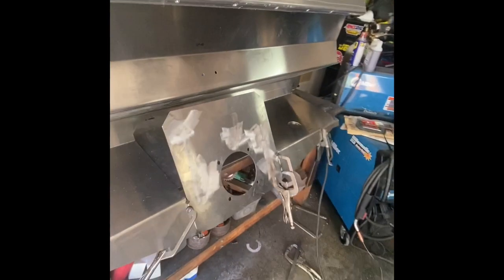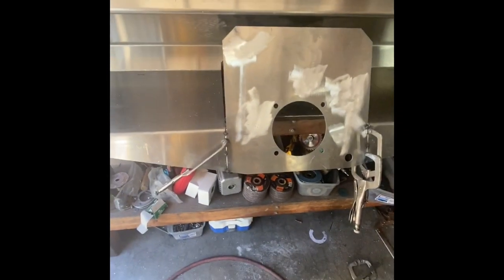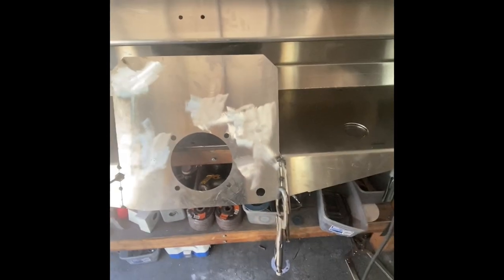The transom isn't exactly a simple one-piece deal - because of all the press brake work for the swim step, you kind of have to piece together the actual transom plate and the tunnel box for the hydro blaster. I got the face plate in there, lined it up exactly with the bottom of the boat, got it clamped and tacked into position, and the next thing is to fill the void with the tunnel. The parts and pieces are cut out so nicely - every single one of these joints is a no-brainer, the thing goes together really, really good. I put a little chamfer in there, clamped it all nice and flush. They say to TIG weld these together; I'm contemplating doing that or maybe doing a mix with the wire feed.